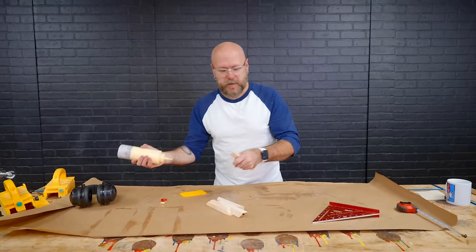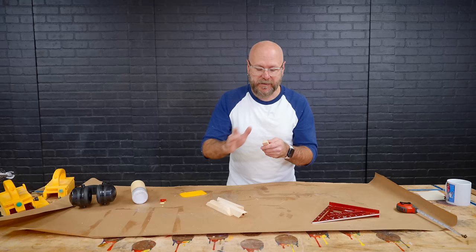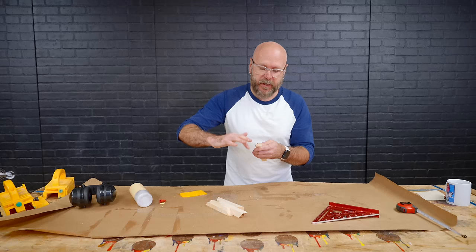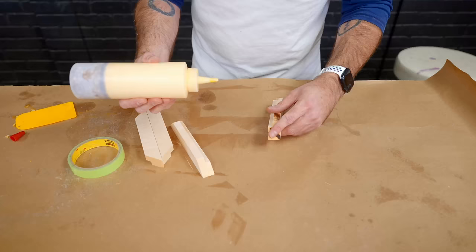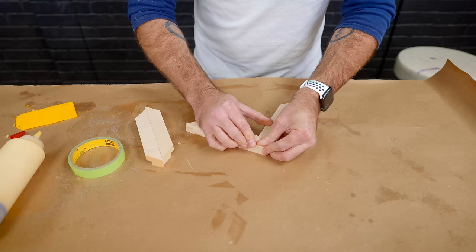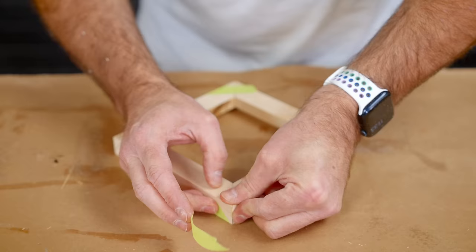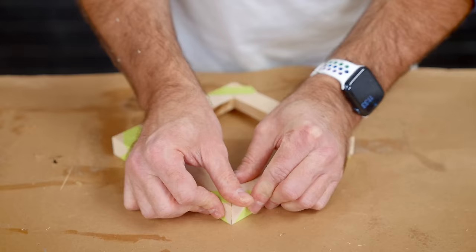Since this picture frame is so small, I'm not going to do anything to reinforce the corners, but I am going to put glue on the ends, let that dry and then re-glue. This will fill up the end grain and create a stronger joint because that end grain likes to soak up all that glue. Now that that has had time to dry, we're going to actually glue these together. For something this small, I'm just going to use some tape. I find that this green tape is stretchier than the blue tape and works as a nice clamp. Make sure on the front side you've got some nice tight seams and just let that dry for an hour or so.